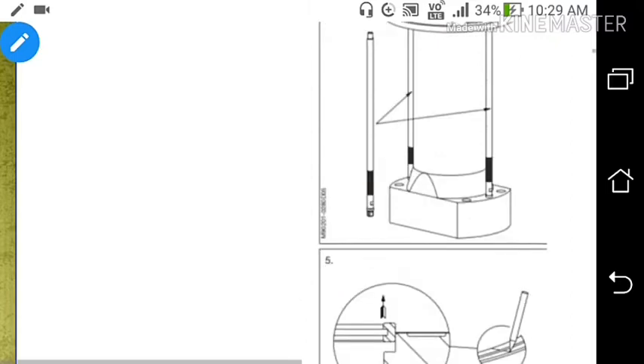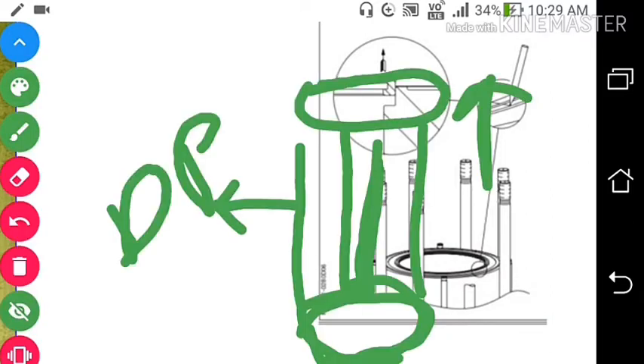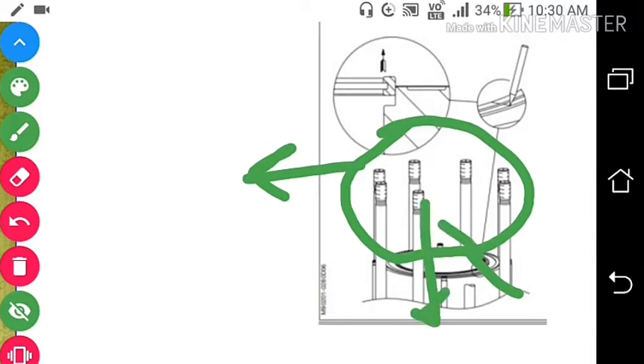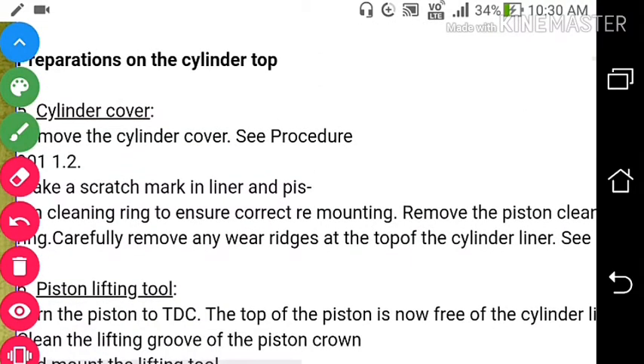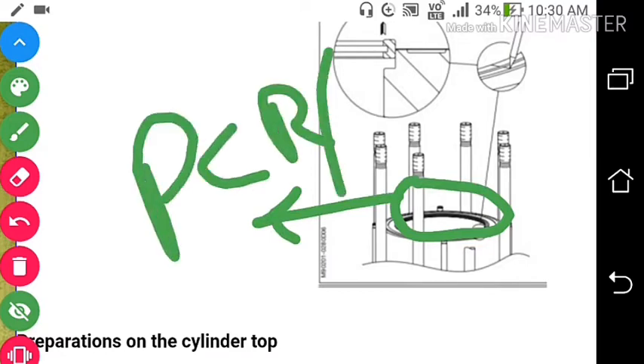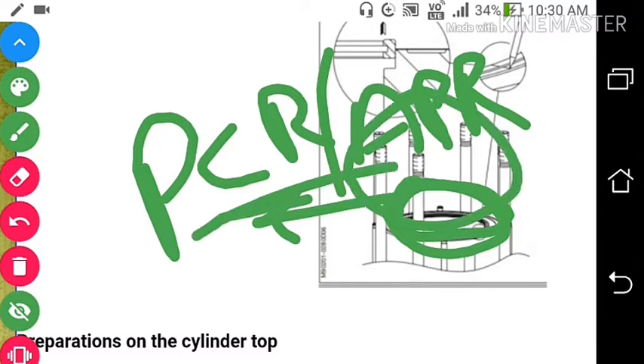Number 4: Mount the two piston pieces on the piston rod foot to protect the lower scraper ring and to guide the stuffing box. Number 5: After taking out the cylinder cover, we will make a scratch mark on the liner so that during assembly of the piston, we can insert the piston back at that same position. We will also remove the piston cleaning ring, also called the anti-polishing ring, after taking out the cylinder cover from the engine.